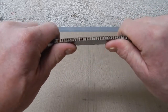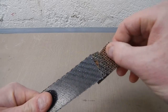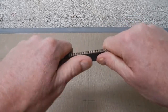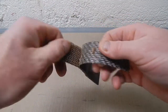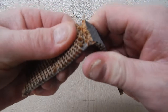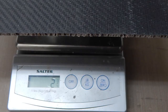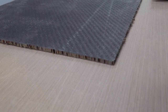Here is my breaking test — got about a 25mm wide strip. You can see how it fails: the core seems to be less stuck to the top skin than to the bottom skin, which makes sense. It's not very robust stuff, but it's better than I thought it would be. Given how light it is, you can't expect much, but it does look like it's glued okay — nowhere near as good as it would be with glue film, but there's no additional weight. It ended up really light: 80 grams — two or three quarter ounces for the one square foot panel. It would certainly be useful for something very light.